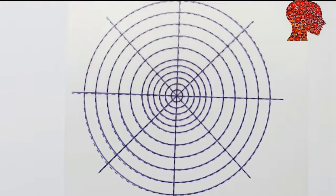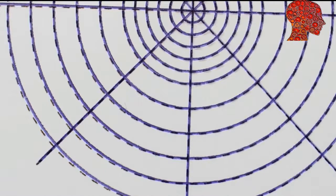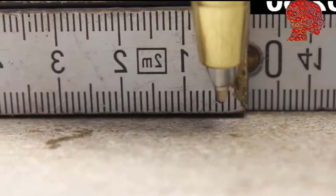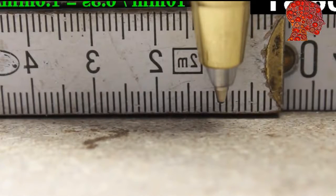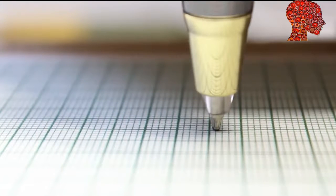The plot is compared with that pattern printed on a foil using an inkjet printer. There are noticeable deviations, but considering the simple construction, the result is not too bad. The maximum speed is just around 1mm per second, you need patience when working with that machine. When moving the pen to one point from both directions, you can determine how precisely you have adjusted the drive. The error is just a minor fraction of a millimeter, not so bad for that cheap machine.